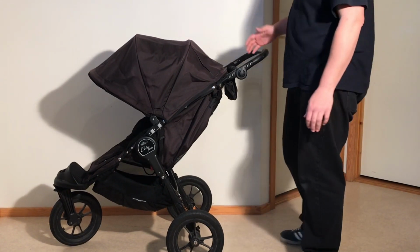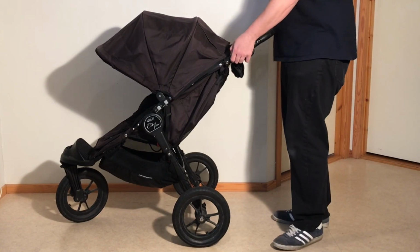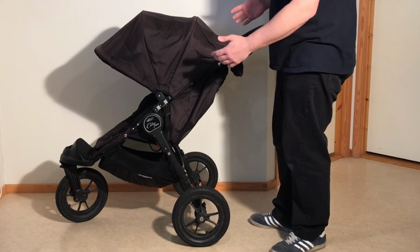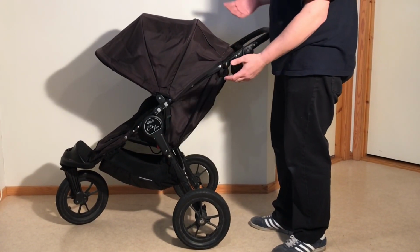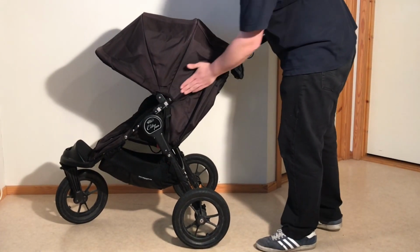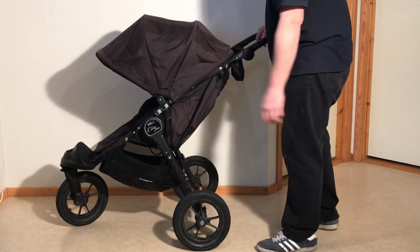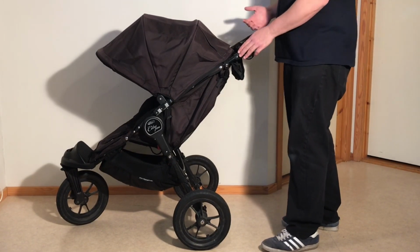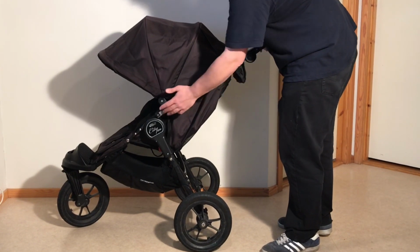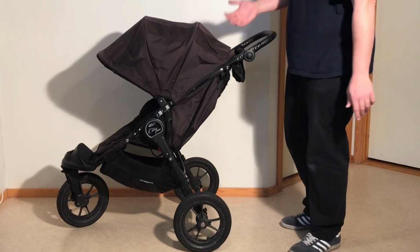So we'll look at this top to bottom, and the weakest point is really on the top, and that is the handle. This is built of a relatively lightweight aluminum. It's not a bad construction material, but because of its, again, very capable driving ability, you're going to have a lot of stress put on metal. And the key stress does occur with the top handle section, which is divided into several areas that are screwed together. And the screw points can weaken, and if people aren't careful to check the screw points, in particular down here where the handle screws into the central mechanism, then the handle can have a tendency to break. Again, I'd like to stress that it's not built as a weakness.